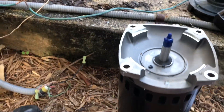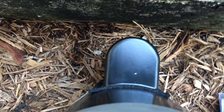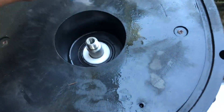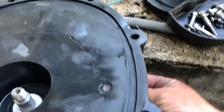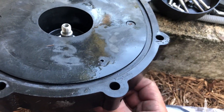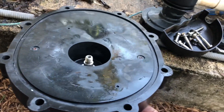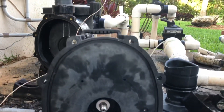With the new seal installed, we're going to place the seal plate on top of the motor. The top of the motor is where the handle was, right where the capacitor sits. That's how you orientate the seal plate. Put it on there and ensure you do not pop that seal out of place when you slide it onto the shaft. Then get your bolts, put them in and tighten it down all the way around — this is where the motor bolts up to the pump.